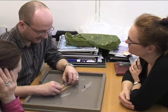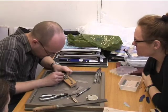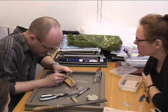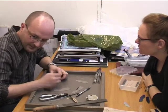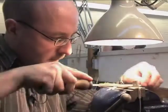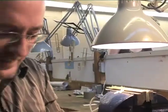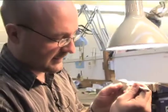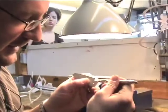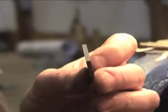Start nibbling at things until it's almost looking like it'll fit together. There's still a trace of the template outline for that notch — I'll file that up to make it sweet and then scribe through that to tell me how to modify the spine. At that point we'll heat treat it. All I'm really interested in is how that point touches the underside of the spine and how that region touches the end. The rest doesn't have to be a precise fit, but I will make it nice and rounded and amenable to having dirt flicked out of it.